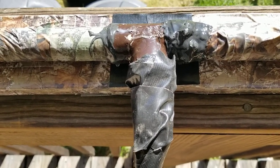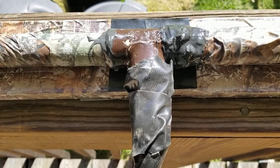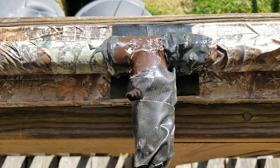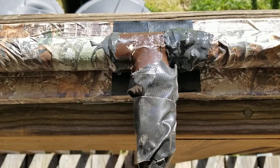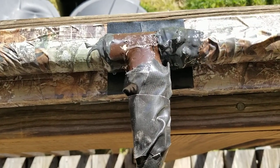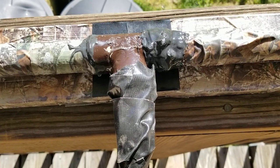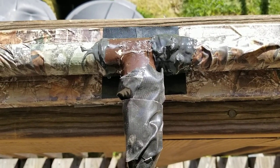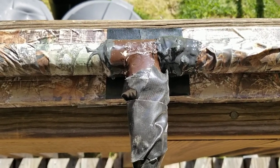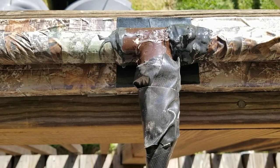What I like about the speaker wire - if something fell down off your roof or something happened, you can take this antenna and re-put it in another PVC pipe and repair it. As long as the silver thing is in good shape, it's flexible and durable. It will actually survive better than copper wire - copper wire will definitely bend, but the speaker wire is a good flexible option. I want people to learn this to build their own antennas for their CB radios.